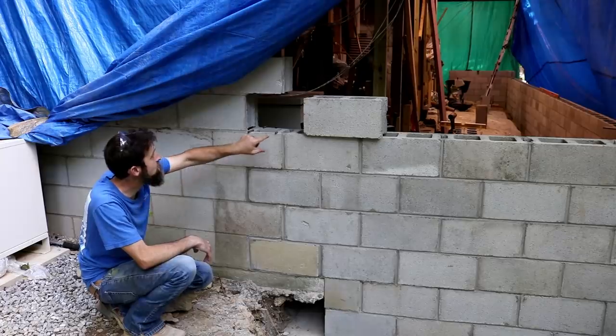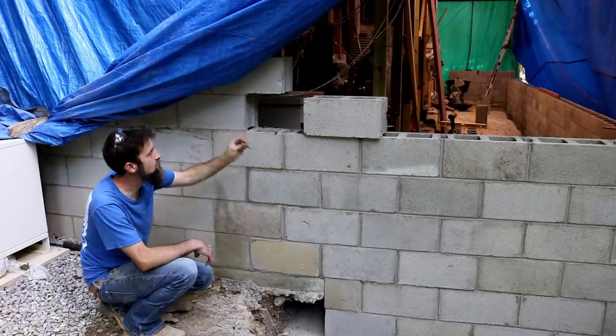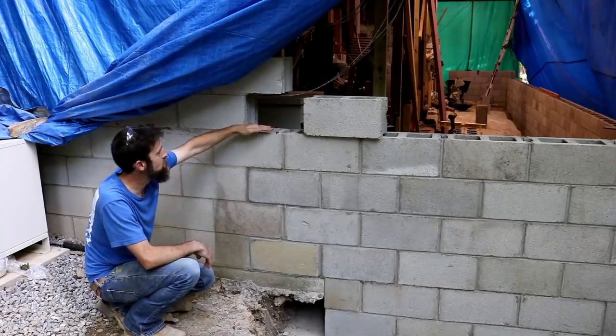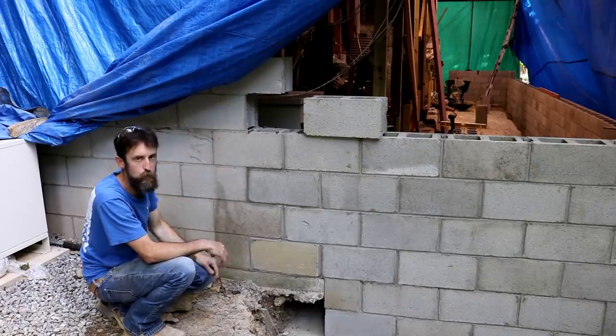The way that I'm getting these blocks into these sockets and getting them full of mortar and centered is I'm just setting some pins in here, moving the block in. This holds my mortar gap space below the block, keeps it level, and then I just take that grout bag and pump around it, and it holds it pretty good.